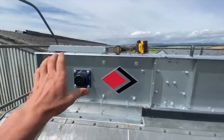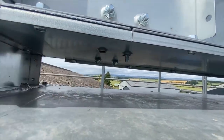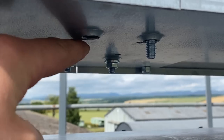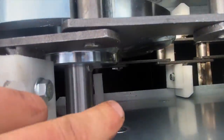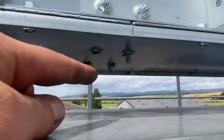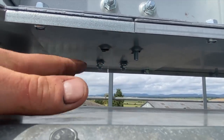Spraying done. Just on top of the dryer at the moment. New conveyor that's gone in. Sparky was wiring it up. Basically there's two nuts on this side - one's now missing. Two bolts there, one's now missing. So obviously forgot to put nuts on the end of them, and this one's popped up. You can see where it's caught one of the paddles, so it's taken a wee chunk out of it where it's hit the bolt. Sparky heard it falling down the dryer and then turned it off and obviously found that - that was the issue. So I'll get this panel off the top and need to replace one of these and put nuts on the end of both of them. Obviously just missed that. Anyway, these things happen.